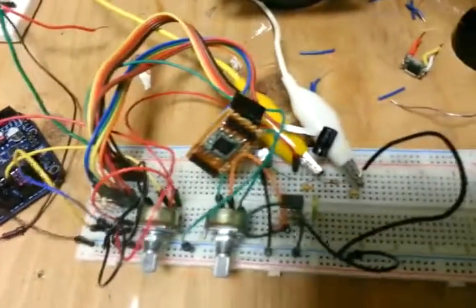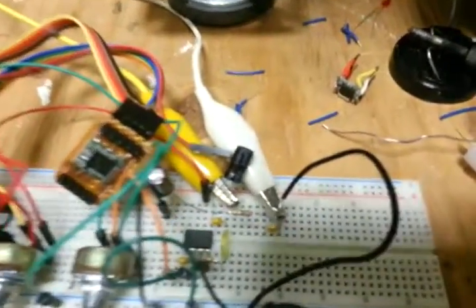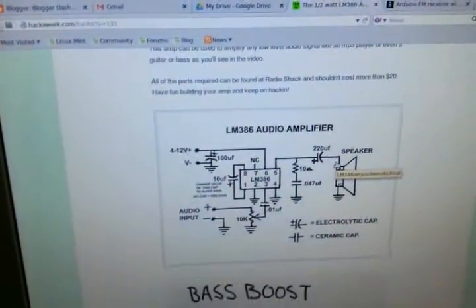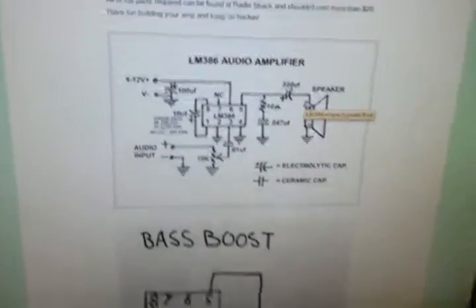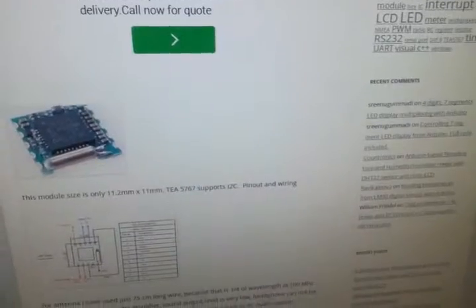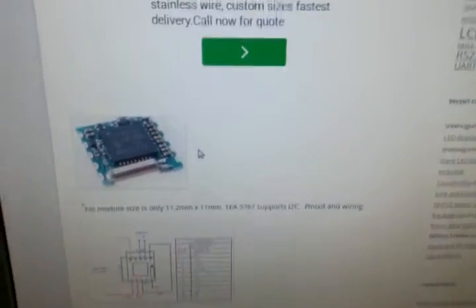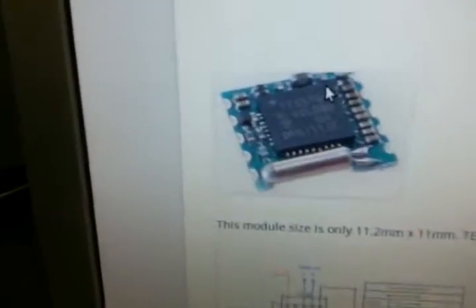I will fix that — it is a software thing. I just wanted to make sure this would work. The schematic I used for the LM386 is a little half-watt amplifier. Here is the website for Hackaday — he has got one on there and I will link it on my blog. He has a pretty good blog and does videos on YouTube as well. The chap I used to get information on the TEA5767 — I will post his as well: electronicsblog.net. There is a picture of the FM module on his website with pinouts and he posted his code.